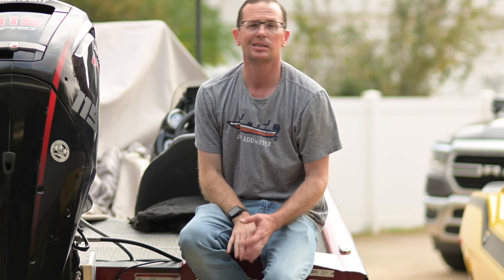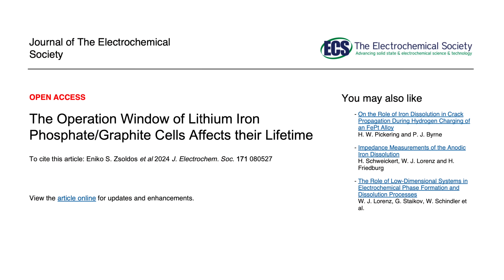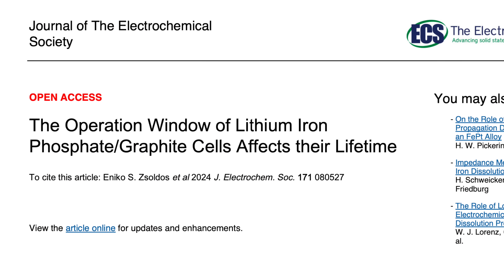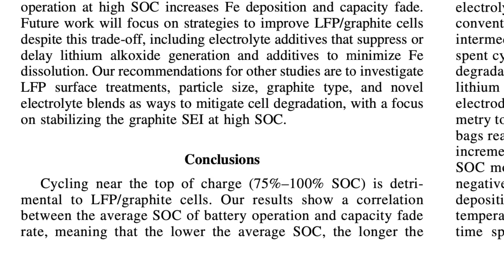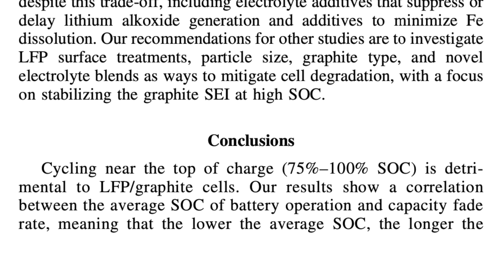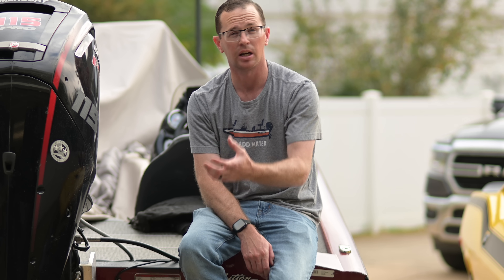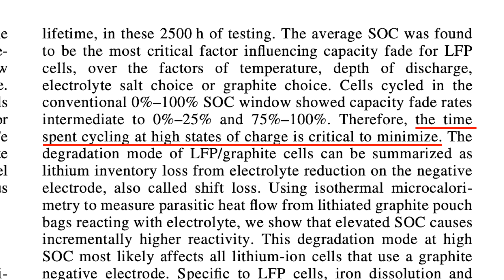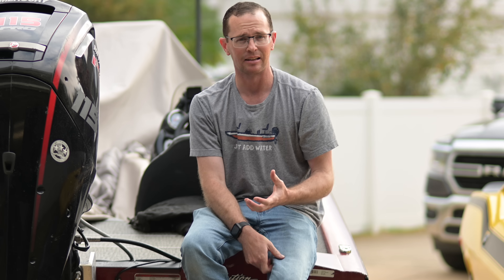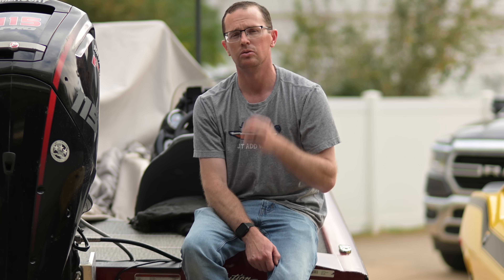You want to keep your battery in that sweet spot. There's been a study released by the Journal of Electrochemical Society covering the operation window of lithium iron phosphate — LiFePO4 — cells. The very first sentence in the conclusion states: cycling near the top of charge, 75 to 100%, is detrimental to LFP cells. It also states that time spent cycling at high states of charge is critical to minimize. That's directed at people using 10 to 15% of their battery capacity and charging right back up to the top — you don't want to do that.